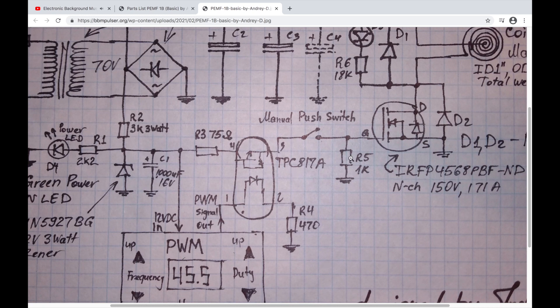You basically have two resistors: the first resistor is to turn the MOSFET ON, and the second resistor is to turn the MOSFET OFF. Anytime there is no power traveling through, you have a current-sinking resistor that pulls the gate to ground, turning the MOSFET off. You must have this, and it has to be 1 kilohm — a quarter-watt resistor.